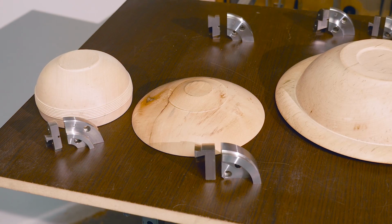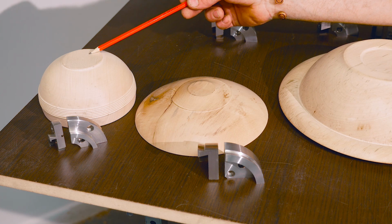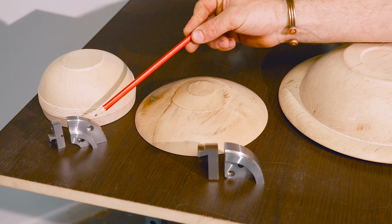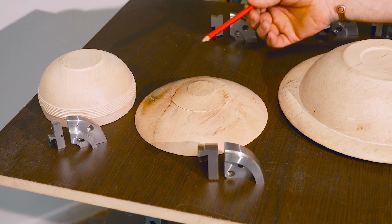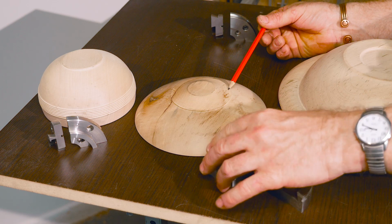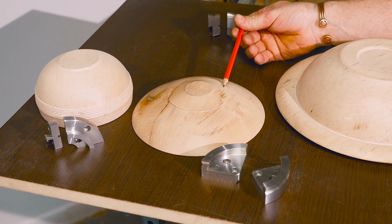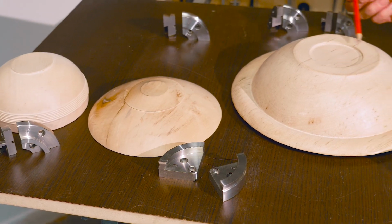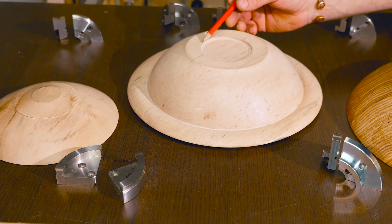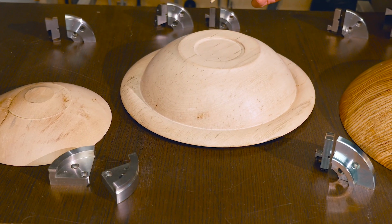So each of the bowls here has been held on a set of dovetail jaws. So the small bowl far side, a bit of sycamore, has been held internally, straight lip, gripped inside the small C jaws here. Next bowl along, we've just shown you, held on this lip on the A+ jaws. So much bigger size, allows us greater stability while turning it on that little lip. Sycamore bowl here, we've got a nice dovetail recess, wide foot. We've got our dovetail shape, expand into. It's there, it's visible, part of the bowl.